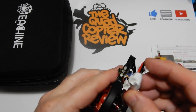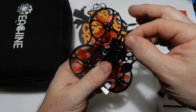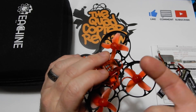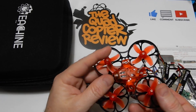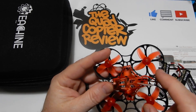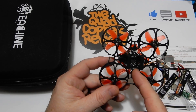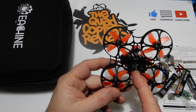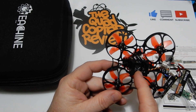In another video I'm going to switch it to the XT30 and see how it performs that way. Another thing I don't like, as usual with these boards, is the receiver antenna is underneath it and you never have a good place for it to go. The VTX antenna is also on a connector so you could switch that out for a lollipop or anything else. This is running a 6-amp ESC, it's DShot 600 ready so you can turtle mode it, and it has the LC filters and a current meter up to 28 amps.